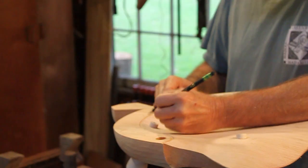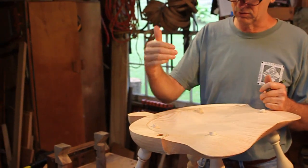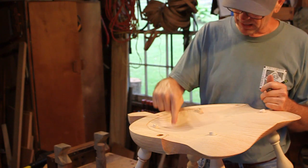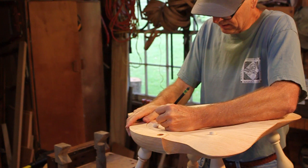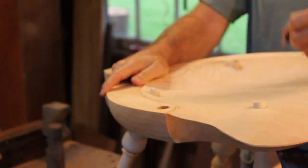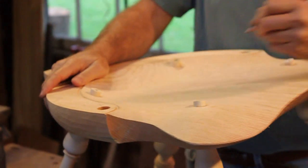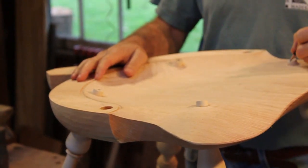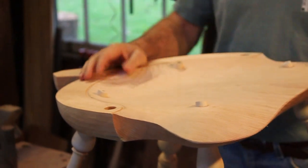Now, of course, wedges always are perpendicular to the longwood fibers of the mortise piece. The direction of the wedge is determined by the mortise piece, not by the tenon. So that is the direction of the wedges right here. Now you can't mess with that direction either. That's one thing that's kind of written in stone there.